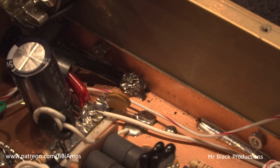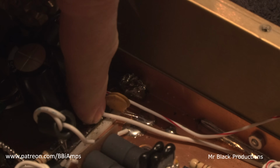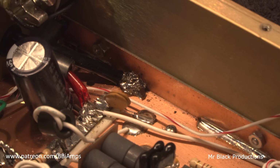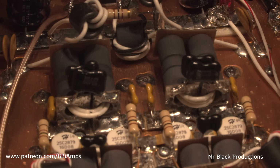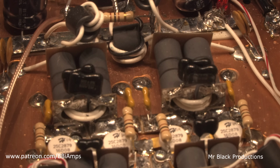I can tell just by the way that this wire was put in here that somebody took their iron and jammed it on here, slobbed solder on it, and then just pulled it off and never bothered to reflow it. That's not a characteristic of Joe. Joe doesn't use these 5/8 or these 1/2-inch transformers, the 1/2 x 1/2 cores. He builds more with my style of transformer, primarily, and he's still using them.